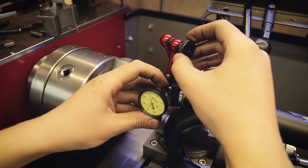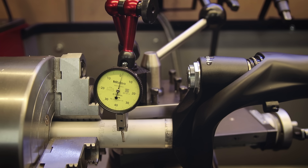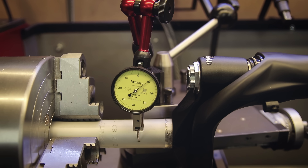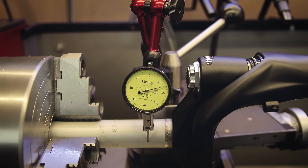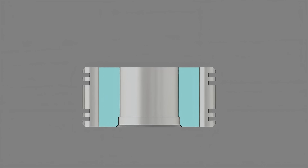I'm putting the fork on the lathe — just using it as a measuring device, not actually starting it. With an indicator set up, moving the carriage towards the crown clearly shows the steerer gets ever so slightly thicker towards the crown: only about two tenths of a millimeter over 40mm, so you can barely see it with your eyes, but unfortunately it does complicate things.